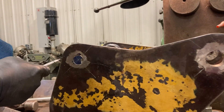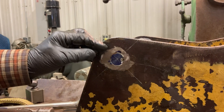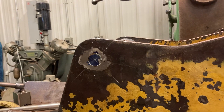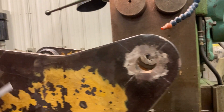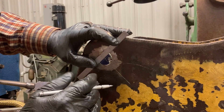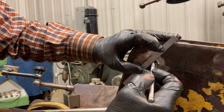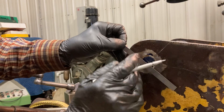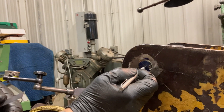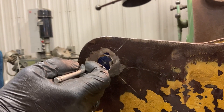Once those were scribed on our piece, we made little discs that were close to those welded-up holes, tapped them in place a little bit, and put something on the back side to hold them. We then took our steel rule and, off of those scribed lines on the piece, came across and scribed the plug for our crosshairs. We took our center punch and punched the center mark where they intersected, so that gave us a reference for picking that up after the holes were welded.